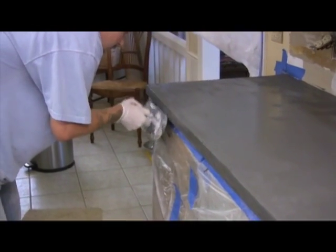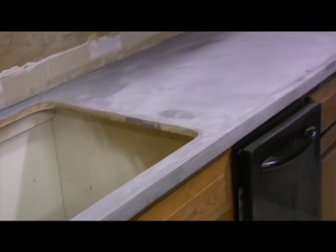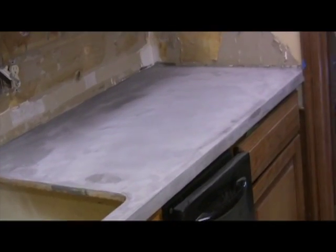An insider tip. For a greater sense of depth and translucence, color the top coat slightly differently and pull it tight with a trowel, allowing the bond coat color underneath to show through. Then lightly sand away a bit of the top coat, revealing more of the bond coat underneath. We always suggest making samples before doing the actual surface. Lightly sand the top using 220 grit sandpaper.